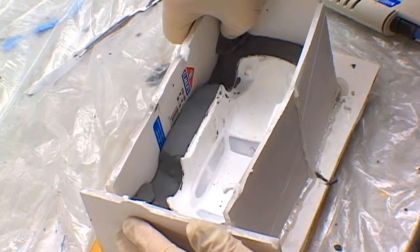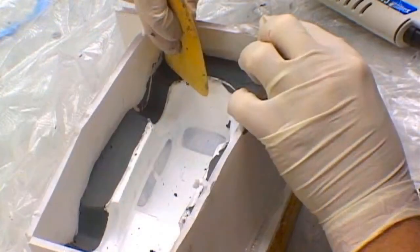After the foam board wall is completed, small pieces of clay are placed inside where the foam board meets the clay parting line to seal the gap. If the gap isn't sealed, silicone will leak out. Clay the entire gap and then up the sides where the foam boards meet each of its sections. Now you must return and re-smooth the clay wall so it remains 90 degrees to the edge of the model.